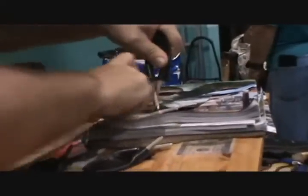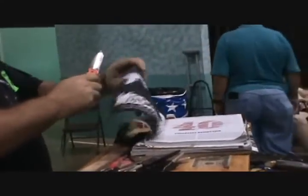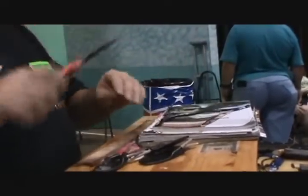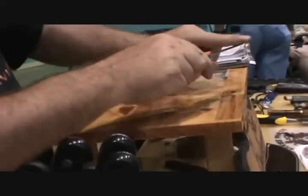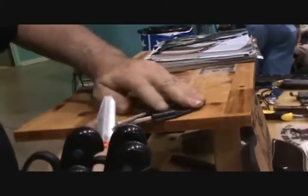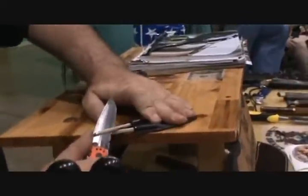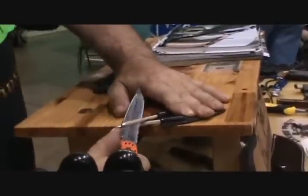Get them right from the bottom of the tooth right to the top of the pin. Watch this. That's the serrated part. Now on the smooth part of the blade, this is a one-sided blade. You're flat here, your blade's on this side. These are the only ones you do this to. You hold the flat side up against the pin, the other pin will pick up the angle of the blade. Being a round, flexible pin, they can grab any angle you got.